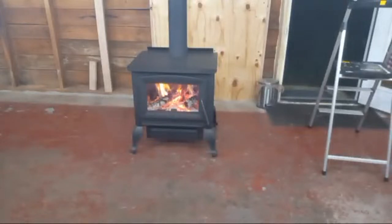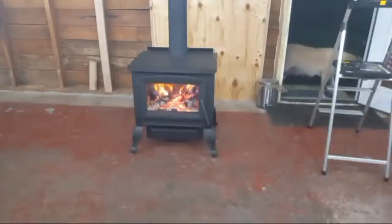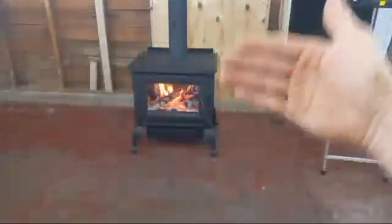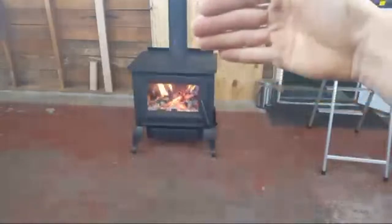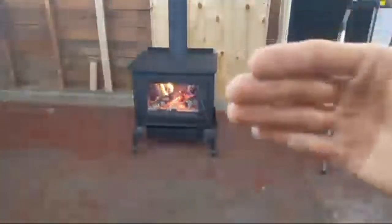In these new stoves, right above the door in the ceiling, there's a white board called a baffle — a fire baffle. During shipping it shifted and moved to the front. It's supposed to be all the way against the back wall so that the heat and flames coming up don't go straight into the chimney. It's supposed to bring the heat forward, come up between the baffle and the top of the wood stove, go across the top plate, and then up the stove pipe.